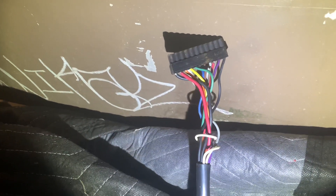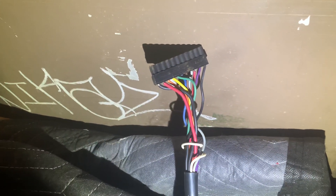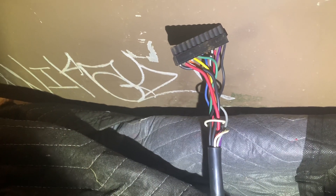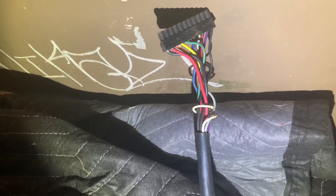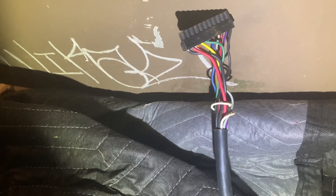The wire coming from the rotator is right here — it has many wires in it. The two wires on the very left are for the rotator power. The rest of the wires are for the rotator position measuring assembly. The position measuring on the siren is accomplished using a black plastic disc engraved with several slots in it, and it is read by a series of five photodiodes and five infrared LEDs.